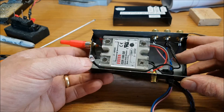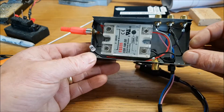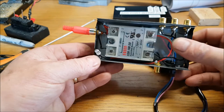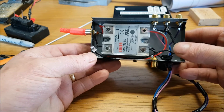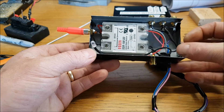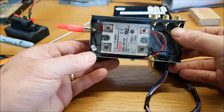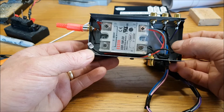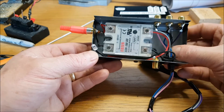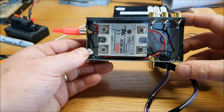Just as I said before, when you're doing your ground wires here, the temptation would be to link one to the other and then go back to the plug — but don't do that. You have one single ground wire: all your wires come back to it and are soldered together with a little bit of heat shrink around it, so you won't have any ground loops, which can cause hum and buzz and all sorts of carry on like that. That is the way to do it.